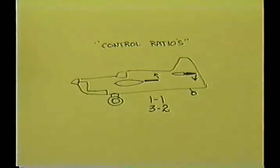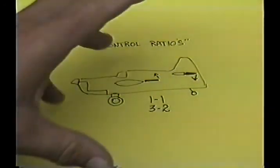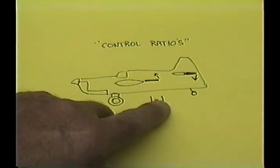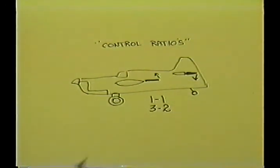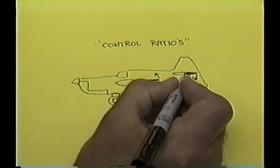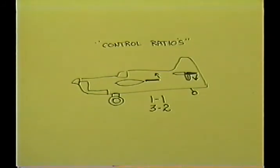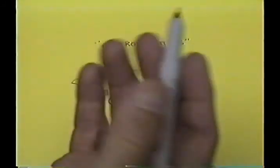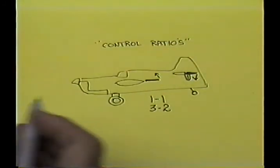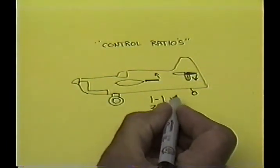But our objective always is to start off trimming a plane, at least in the first getting friendly and used to the plane, with a 1-to-1 ratio. But what we always try to do, and in the case of Miss Ashley, we have never even tried these other ratios, we have three choices. And what we're going to do right now is take the plane apart, because that's what's nice about a take-apart plane, and just experiment a bit. We know that 1-to-1 seems to work pretty well.